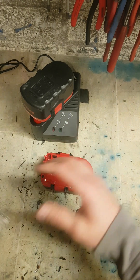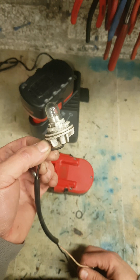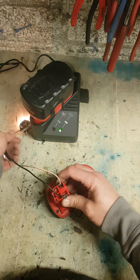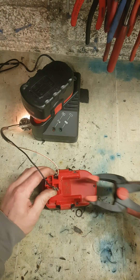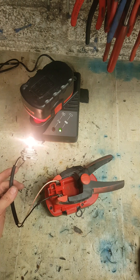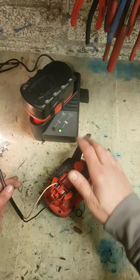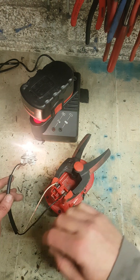But if they are like that and no longer holding the charge, what you need is a 24-volt bulb on a lead. All you need to do is stick your bulb onto your terminals, clamp them on, and leave that bulb to run and completely drain the battery — totally flat. Once that bulb has no light whatsoever, take your battery, stick it on your charger, give it a full charge. Once charged, put your bulb back onto it and completely drain it again. Do that as many times as you want — five, six, seven times at least.